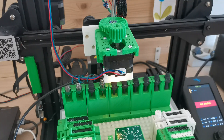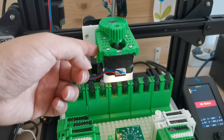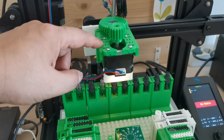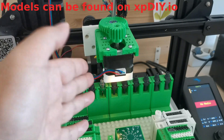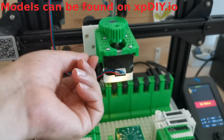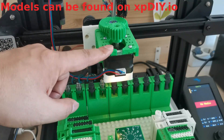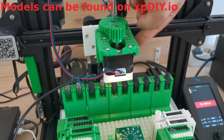So in this improved design I addressed the nozzle head. First, you can see a lot of holes here — these are basically for heat to escape and to ventilate the hot air inside. I also introduced gaps in between to reduce the contact surface and leave air in between, so the heat does not so easily affect the plastic.